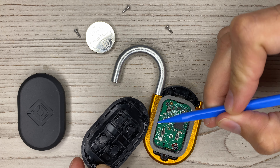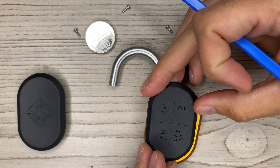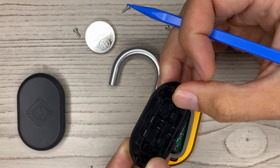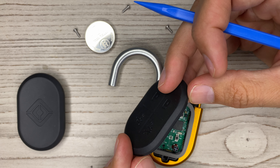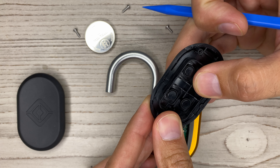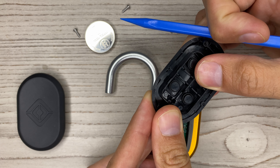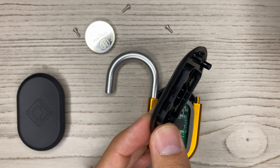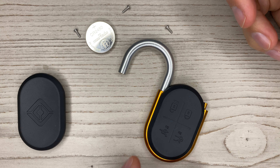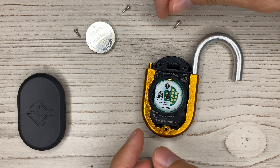There are probably snaps right here that interact with these snaps to help hold it in place. These buttons look like a two-shot mold — it's basically one piece, but when you push the button here, the corresponding button on the board gets triggered. They basically had to make two injection molds to bring this part to life, squirting plastic on top of each other.